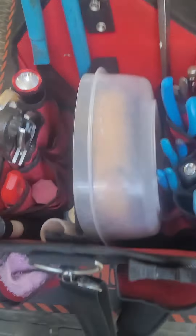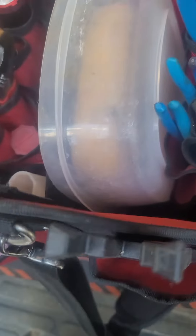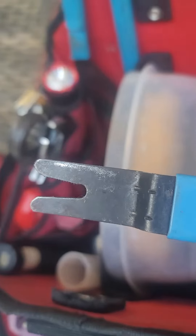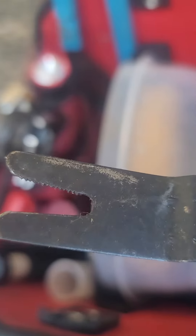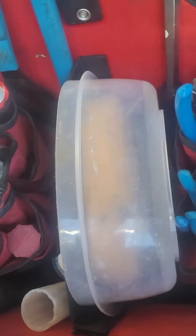This is the inside of a toilet repair bag. This tool right here is used for Sloan Flushmates. This is called a jam bar — it is just awesome. When you have closet bolts where they keep spinning, you're turning the nut but everything's spinning. Those teeth right there, which don't seem like much, they grab that thing like a vise and you can undo that nut. Really, really valuable.